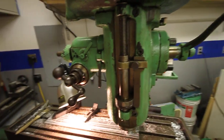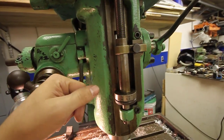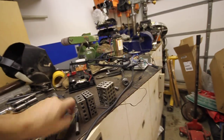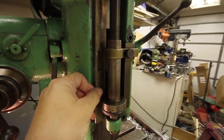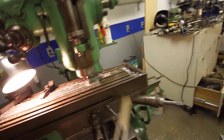Let's take a look at the quill. I've kind of got this disassembled. I have a new spindle in this — I had to replace the spindle because the B&S No. 9 taper on the old one was all torn up. I had a cover plate — it's kind of cool, a scraped cover plate. Just really impressed with these machines. But this little key that keeps the spindle from rotating is a different size than the key that came out of mine, so I've got to fab a new cover plate.